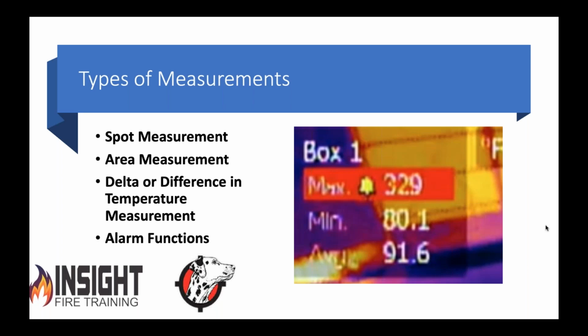If you watch a video you can pull up on why thermocouples are not as accurate as infrared cameras, you'll find out that a lot of manufacturers relied on thermocouple systems that weren't calibrated properly, and they lost a lot of money. One lost a $20 million refinery furnace because the thermocouple system said it was fine, but the infrared camera was reading 600 degrees hotter, and a trained operator was able to compare it and realize, hey, that's not right. They even brought in a second opinion, and they disregarded his opinion until it burned down. Guess what they don't disregard now? His opinion. So they have both systems.